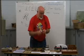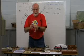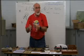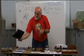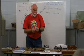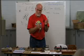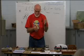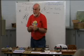But with these, I actually did it once. I ground away the shoulder really fiercely, and the blade went blue with heat. Now normally that would mean that the blade is far too soft to use, and you have to harden it and re-temper it again. In my notes, when I teach this course, I've got a section in the back about hardening and tempering for those who are interested in that, and many people are. But this thing went deep blue. It should have been as soft as anything, and it was just as hard as before. I don't know what's in these things, but it's just amazing. But the beauty of it is, once you've got it set up, it'll last you for a month before you have to resharpen it.